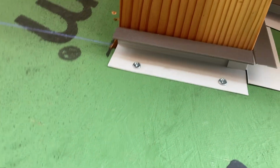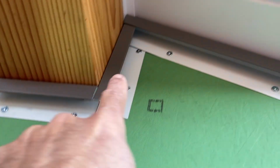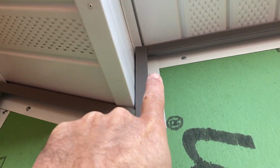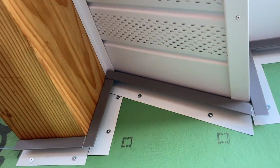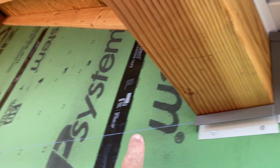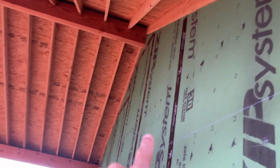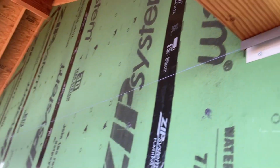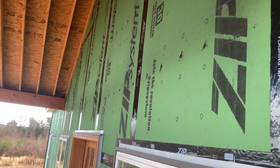Quick look at my transition. You can see the tab bent underneath here, overlapping. Tab bent up underneath here, overlapping up under there. This is going to see very little, if any, weather. We're ending it right here because we're going to put our Z flashing here and create a break. This will be a separate siding area from the bottom. It's just going to make it easier running it, and I'll show you how we do that on the next video.